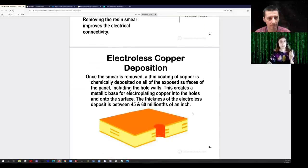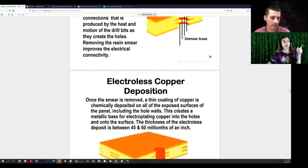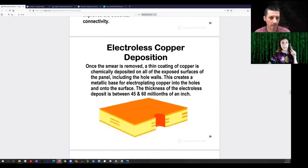There are a few more steps before we can actually electroplate copper. Remember we started with copper foil, and now we've plated electroless copper — but the electroless copper layer is very, very thin. When we electroplate thick copper, we're plating on the outer surfaces as well. That's how you ensure copper runs all the way through the via and electrically connects reliably to both outer foil sides. Typically the foil for a one-ounce copper board will start as half-ounce, and they plate the equivalent of half an ounce of copper through electroplating on the outer surfaces and in the via barrel.